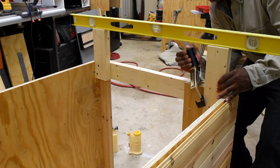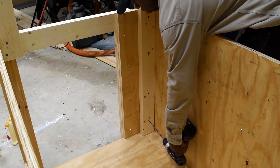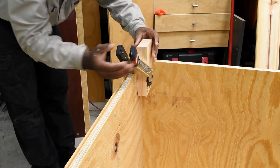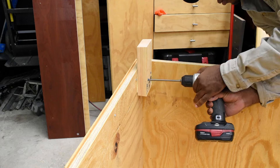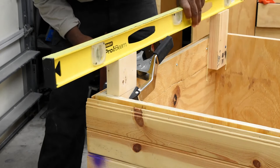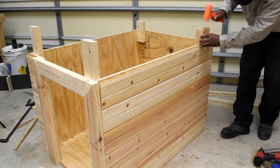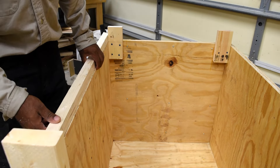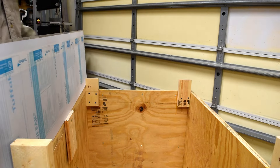This piece of 2x4 is going to go from the floor all the way to the roof. I put a 5-degree pitch on top of the 2x4 and this should help the roof angle down. To come up with that angle I just played the guessing game — whatever looked right is what I did. The back is much lower than the front and that helps with the pitch. All my roof supports are up so it's time to finish the siding. The top part of the plywood is going to be wrapped with some 2x2 trim going around the top perimeter, and to the top of that I'm also going to add some plexiglass. The plexiglass is going to give it a unique design and act as upper windows.